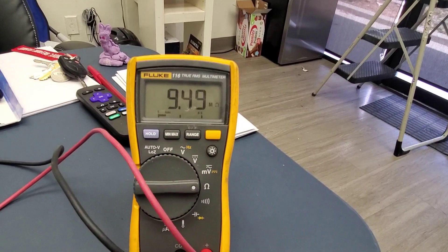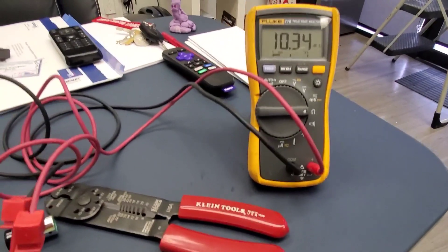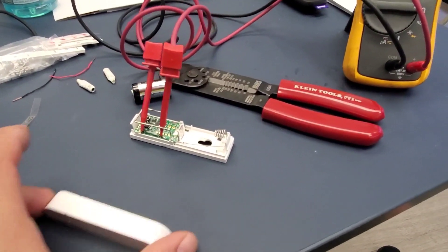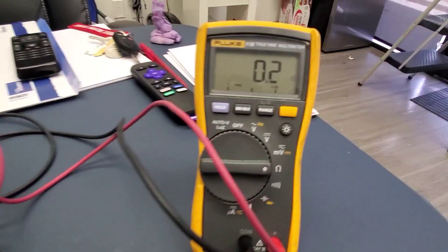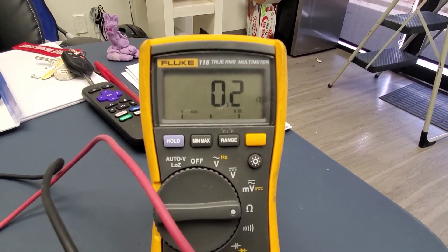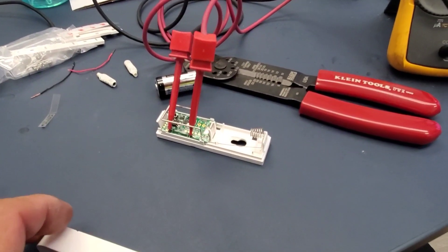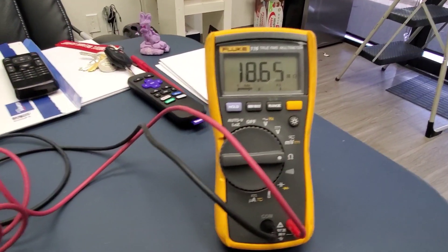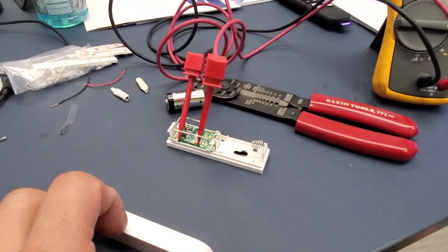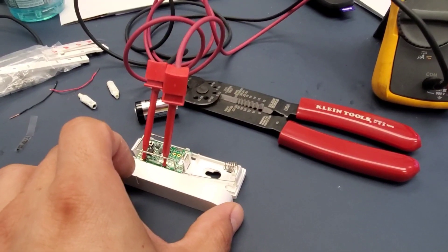Right now we're getting nine megs — basically megs, you have nothing, you have a zero — and that's with the contact on the outside. As soon as I start putting the magnet closer, I'm getting point two ohms. So that's basically how it works: magnet away means megs which is open, and when introduced close you get point two ohms.